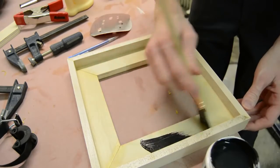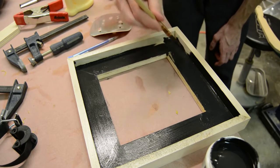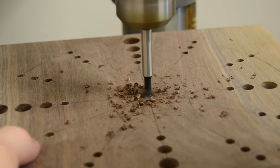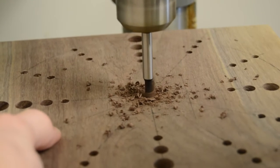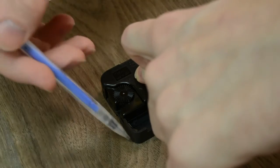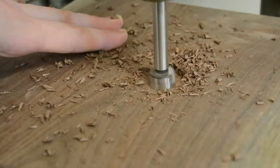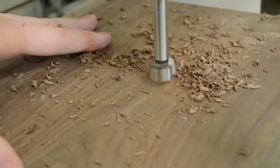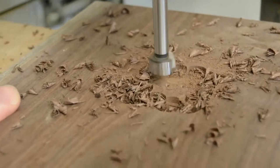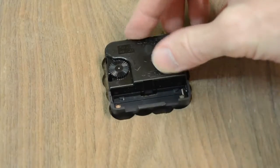To get that nice shadow line around the clock face, not only is the frame cut an eighth of an inch bigger all the way around, but it's also painted on the inside with flat black paint. After waiting over a week for the clock movement to arrive in the mail, I was finally able to drill the recess into the back. The clock face was about three-quarters of an inch thick and the movement allowed for a half-inch thick face, so removing that quarter inch worked out nicely. I wasn't overly concerned with how the recess looked since it wouldn't be seen — I just wanted plenty of room to fit the movement.